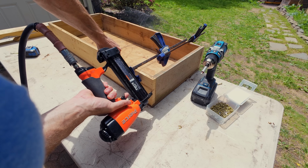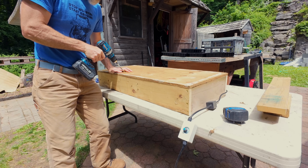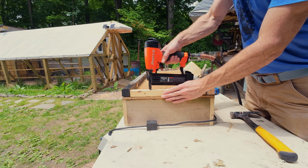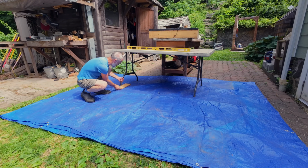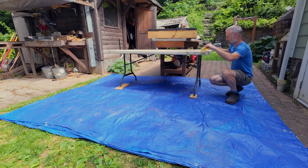I got a cheap vibration motor that is mounted to the underside of this frame that I built from some scrap wood. I designed it so that you can place the 5 trays into this vibration table and they won't slide off. The next thing I did was make sure the table was level so that when everything was shaking, I didn't get crooked pavers.